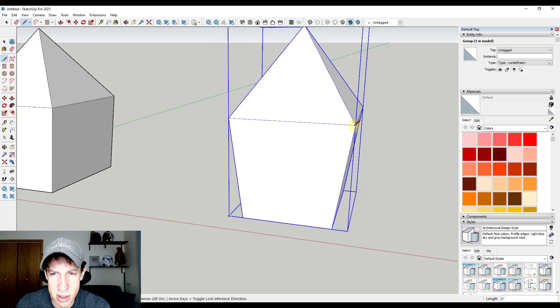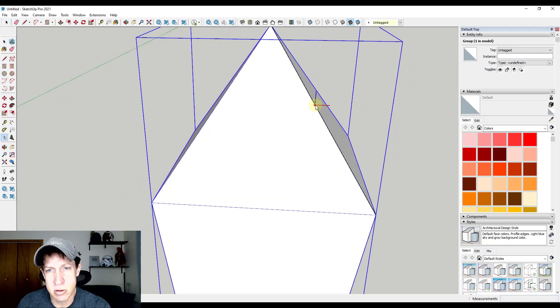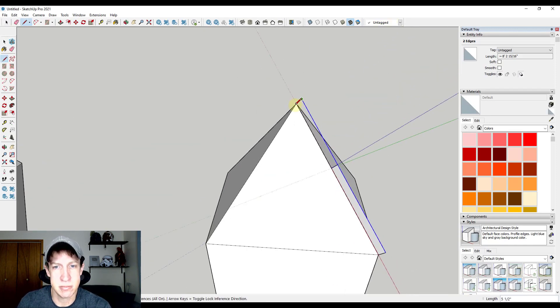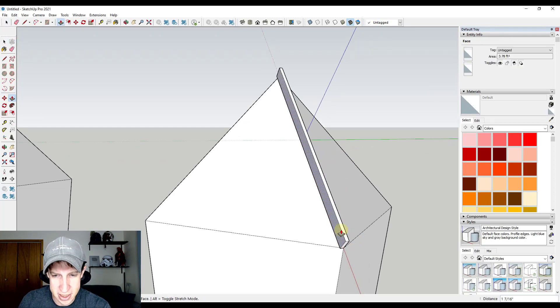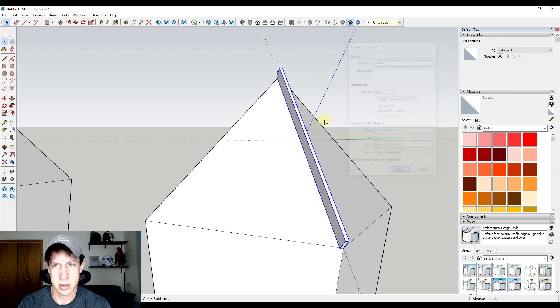I'm assuming we're going to have some kind of board running up to the roof here, and modeling it could be a little tricky at this angle. So I'm going to use the axis tool and align my axis with this point right here. You can't build the whole thing with pallets — you're going to need some kind of 2x6 to act as a rafter. I'm going to say this is 5.5 inches wide. Then I can copy this edge up, draw it in as a surface, give it an inch-and-a-half thickness, triple-click it, and make it a component called 'rafter'.